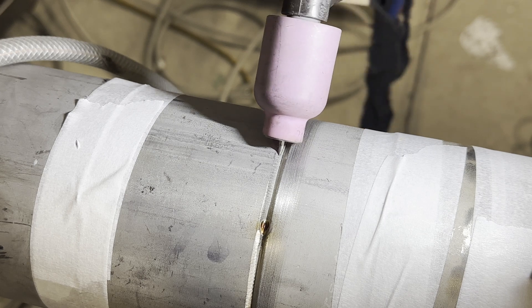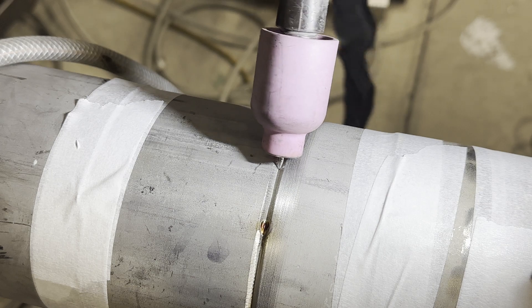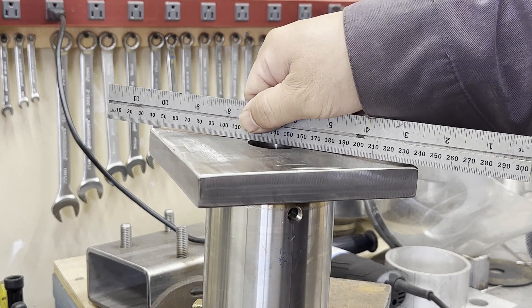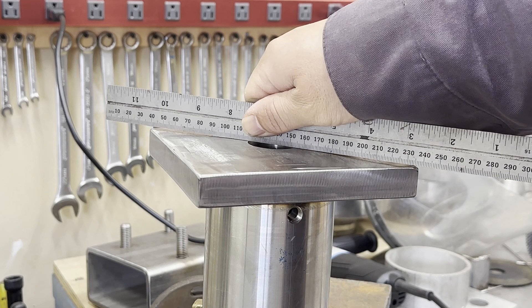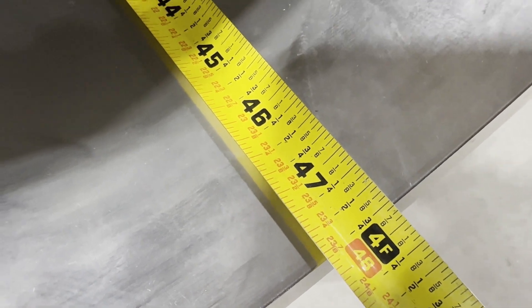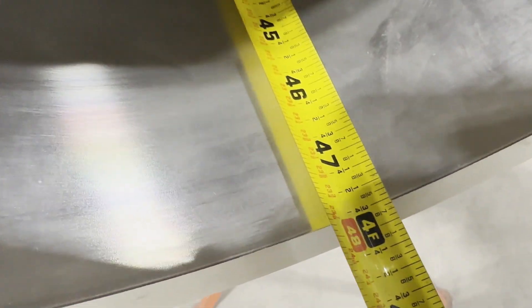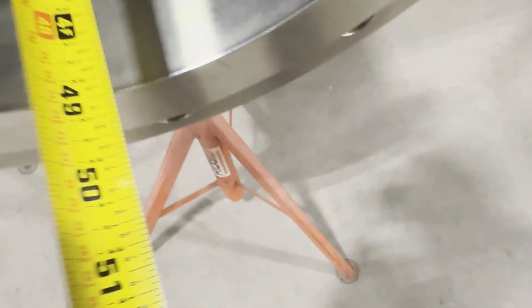The best way is to try and find out how much it shrinks when you weld. Today I explained two very important things: if you weld metal, it warps and it shrinks. You should know how to prevent and fix the warpage, and you should know how to cut pipe size considering shrinkage. Thanks for watching, and see you next time. Bye-bye.